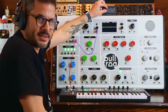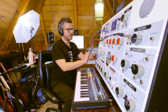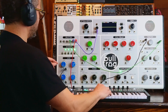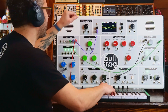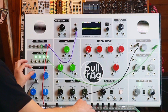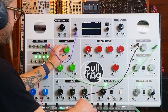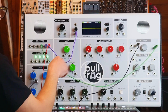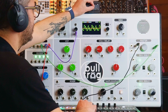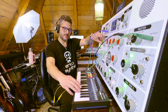An organ will actually have other harmonics than just octaves, but this just approximates the idea. Let's plug in the keyboard — gate in, pitch — and get the output into our audio path, tuning the VCO pitch to the middle. If I turn all the drawbars down, all we get is the top octave, which is the combination of pulse and sine. The audio path is already pre-connected: mixer to filter, filter to VCA. You start getting octaves as you turn the drawbars up and down, and the filter is working as well.